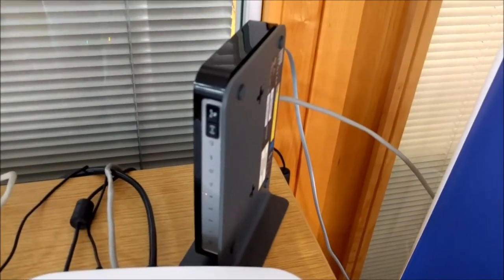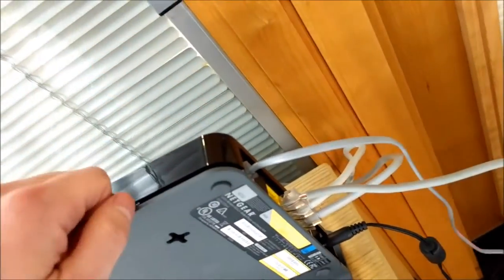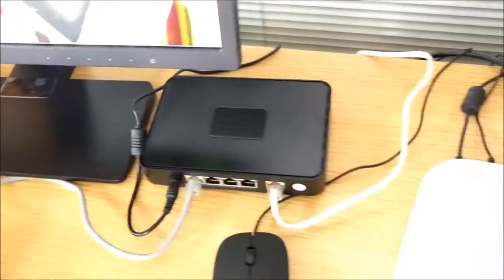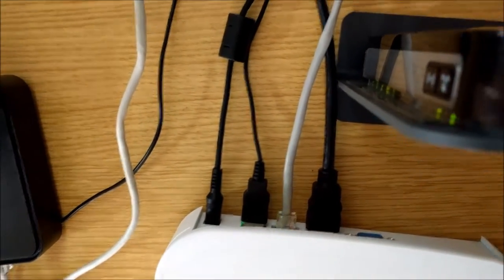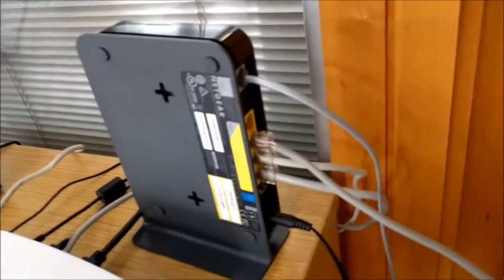You then have an uplink port, which is a non-POE port, and that goes back via Cat5 cable into the back of your broadband router — whether you're on Sky, BT, Virgin, or anyone like that. That's what's going off to our ADSL line with various devices plugged into the back, one of those being the POE switch. Additionally, we've got the network port on the back of the recorder connected via an RJ45 Cat5 patch lead, going straight back into one of the ports on the router.